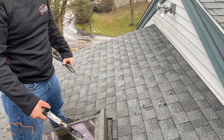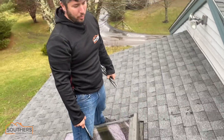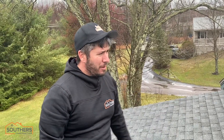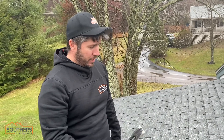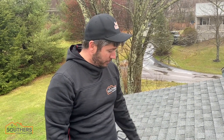So just by taking out a few shingles or cutting out a little bit of the shingle, this skylight's not going to leak anymore. Caulking should be used to seal around a vent or around the water — it's hard to join otherwise. It should never be used as a barrier to keep the water around. Caulking is kind of a last resort or a temporary repair to get you to a permanent fix. This was a brand new roof, and it's been leaking on and off ever since. Now with these skylights, given the breathability for the water to flow left and right, you're not going to have any issues anymore.